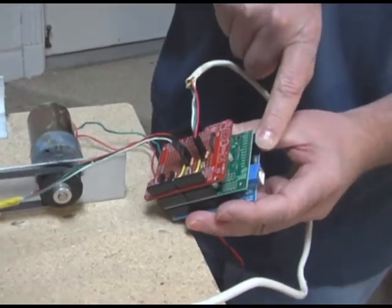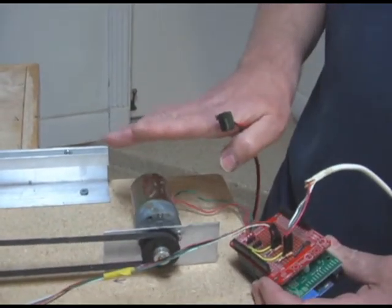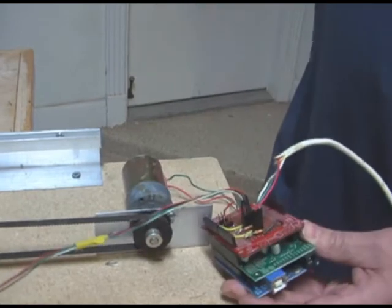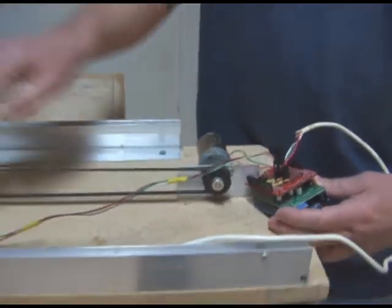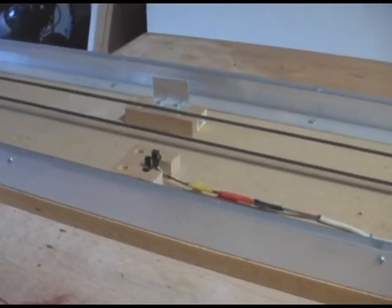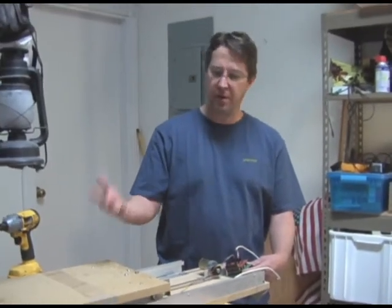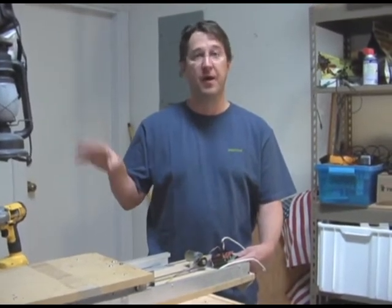I've got 9 volts going to the Arduino board and a separate power connector for the DC gear motor which runs at 12 volts and 152 RPM. Once powered up, the Arduino moves the base down to this end until the near sensor is triggered, then waits. Then it moves to the far end until that sensor triggers and waits for the torso to do all its movements. Then it moves the base back to this end. It just completes that loop over and over — move to one end, stop, move to the other end, stop, and the torso does its movements at the far end.